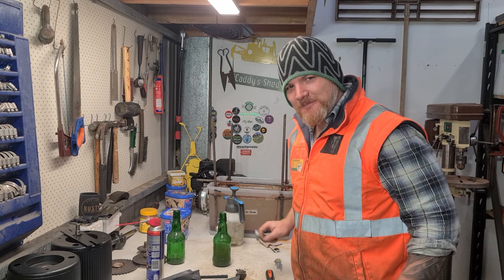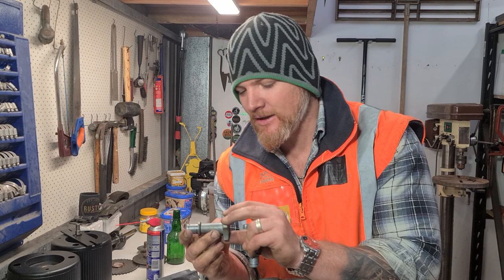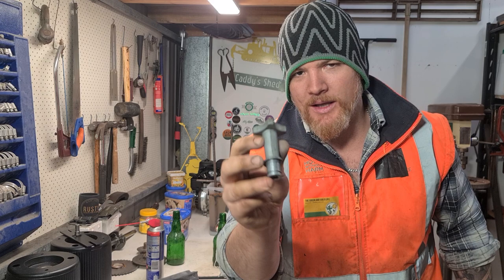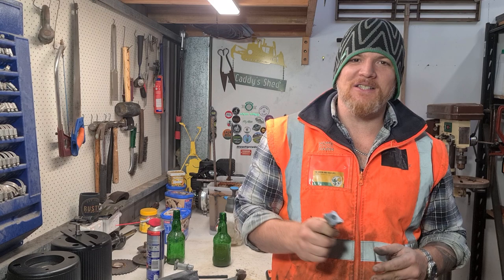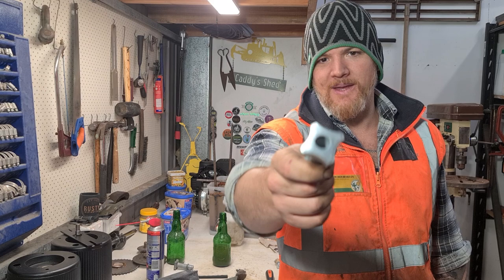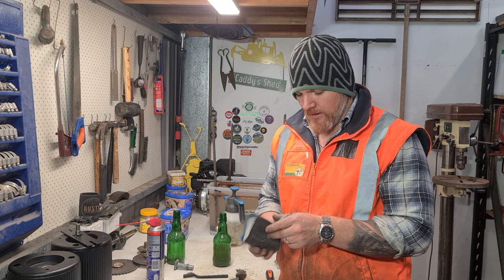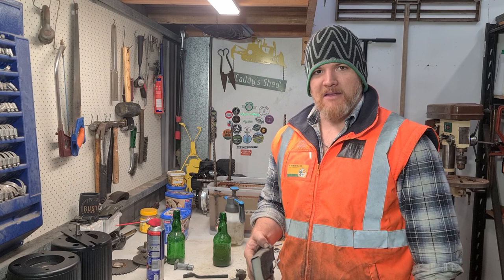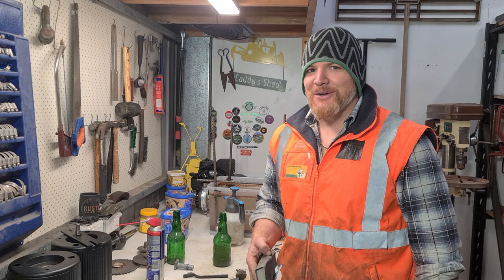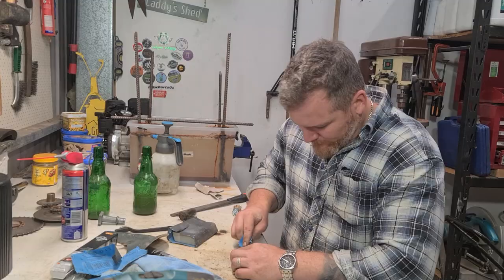In typical fashion, I've gone over the top. Essentially this knob has an imperfection from the casting — up and down where the moulds were joined for the casting process. I've actually gone through with a file and removed that. Now if you want a nice smooth polish you've got to remove all of those scratches. I've done a little bit of work to the top — there were a few dents. I found a little bit of wet and dry sandpaper in the shed. I'm going to start off with P80 to get the deeper gouges out, then go down to 320, then 1500, then 2000 — and then that should be shining. The only problem is more elbow grease.